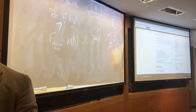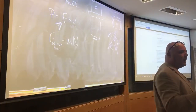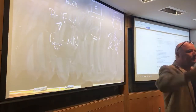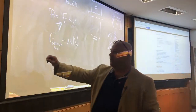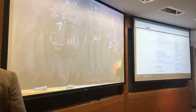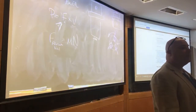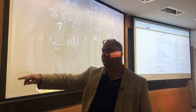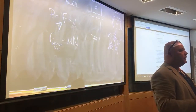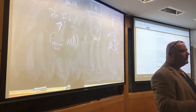So what do we call that? Centrifugal, centripetal? I never remember. The physicists say there's one word we're supposed to use and one we're not, right? But there's an inertia. There's a force that's trying to pull it away, right? So you got to know the mass of these and how fast it's spinning. How fast is it spinning? Whatever the RPM is that we set, right? So if we know the mass and we know how fast it's spinning, how fast are they accelerating away? mv squared over r, right?